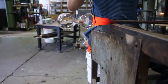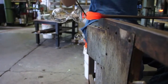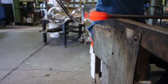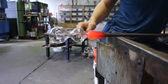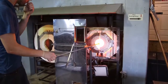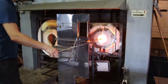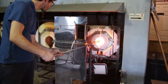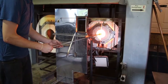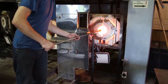It's also a little thicker right next to the pipe — that material is holding heat, which means it's easier to cut in the jack line. Straighten up the bubble again, and that's pretty much it. We do have to flatten the bottom for a real cooling tower or hourglass shape, and you can either do that using a paddle or blow hose, or you can also use spin. Here I'm just heating the bottom and spinning the pipe fast enough that as the material gets hot, it gets flung out to the sides and pretty much automatically sets a flat bottom all on its own. It's just about how deep you heat and how fast you spin.